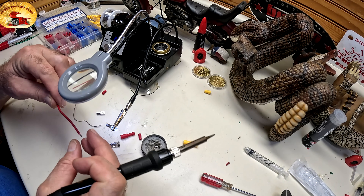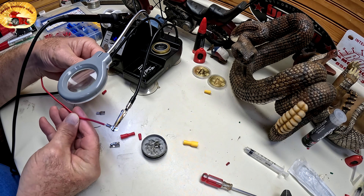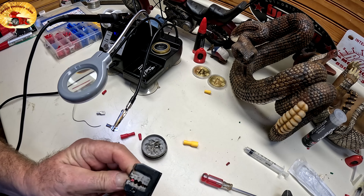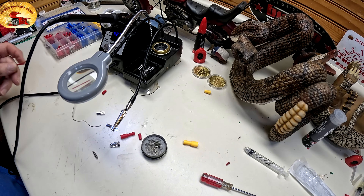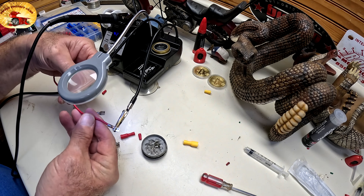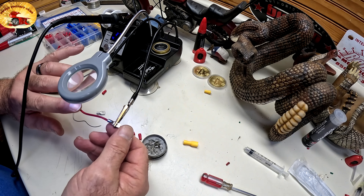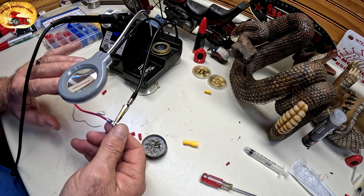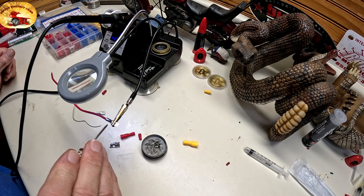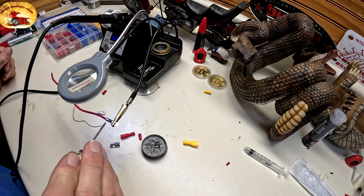What I do is put the wire in the terminal — I'll cut it back a little bit further for the video so you can see it. I like to have the wire protruding out about a sixteenth of an inch or so from the collar.